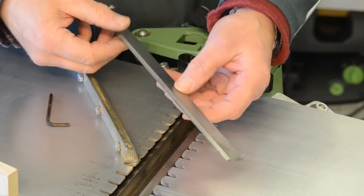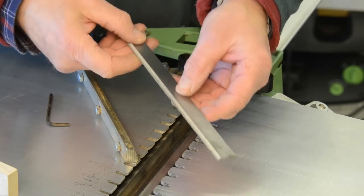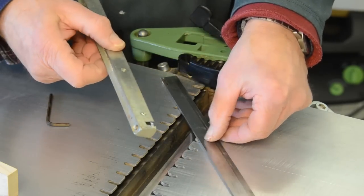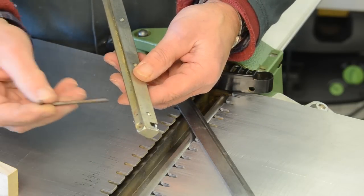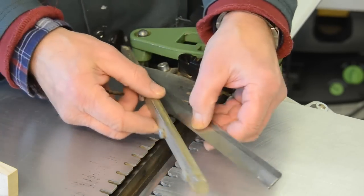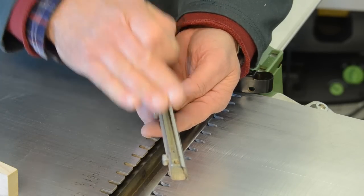My blades are made of tungsten and they're resharpenable with a cutting edge on one side. Some blades are double-sided and some are disposable. The key feature of planer blades is that on the inside you'll find notches, and these notches are there to take the projection from a bolt which goes through the locking bar. Using an allen key you can adjust the position of this bolt, and as you do so that flange on the bolt goes up and down. When you marry the locking bar and the blade together, adjusting the bolt causes the blade to go up and down.